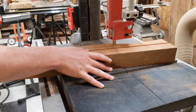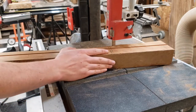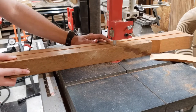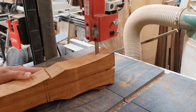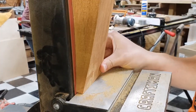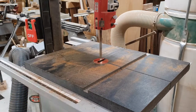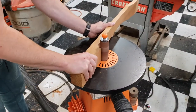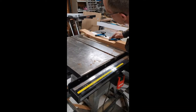After the channel was placed in the middle of the neck, I moved on to rough cuts on the bandsaw to make the neck resemble its final form. I cut all the pieces that I could laying flat on the bandsaw before moving to the angle cuts that would make up the bulk of the neck behind the future headstock. I sanded the angled flat stock cut to ensure that it was completely flat, then flipped over the neck and cut the back side on the bandsaw as well. After smoothing out the curves on a spindle sander, I ran the neck on the table saw to make sure the correct angulations on the side were there and to true up the lines made by the cuts on the bandsaw.